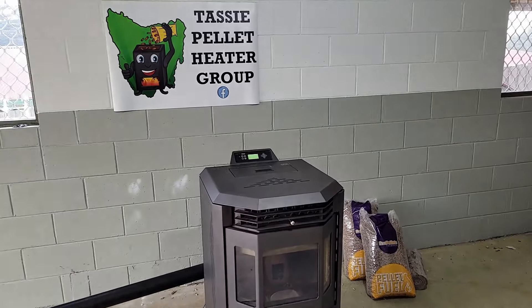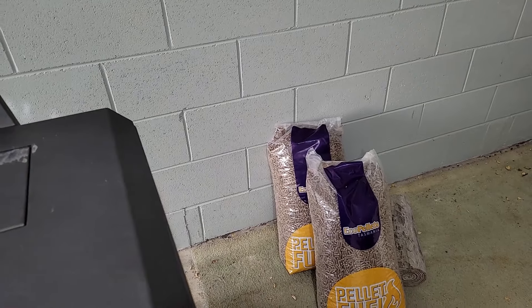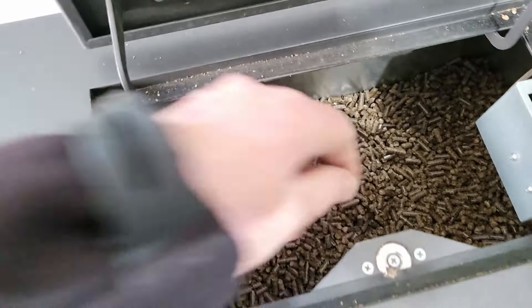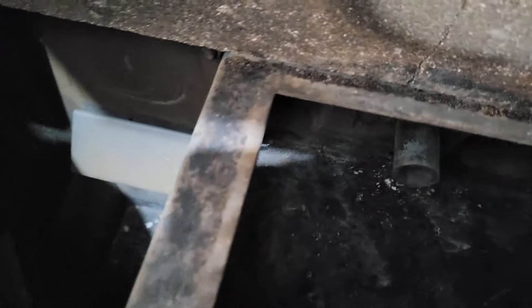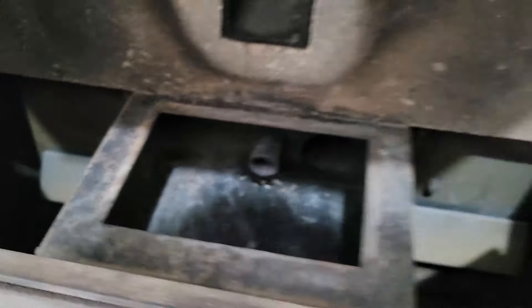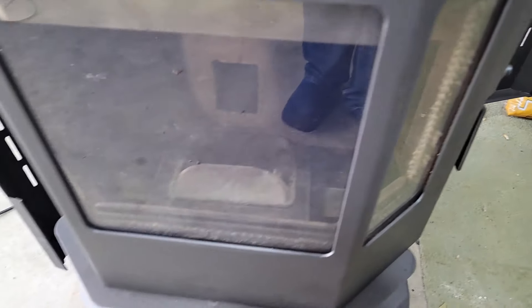What I'm going to do is show you very quickly how a pellet heater works. The pellets go in a hopper for storage, and there's an auger that lifts the pellets up and feeds them down a chute into the burn pot. Just behind the burn pot there's a metal tube with an igniter in it — that heats up the air, which ignites the pellets. The pellets are ignited by hot air; they don't come in contact with the igniter at all.